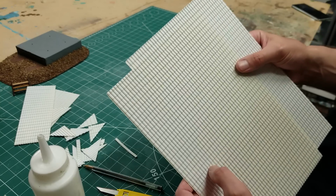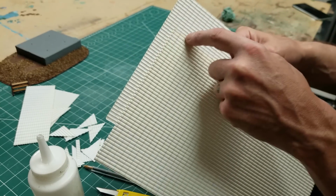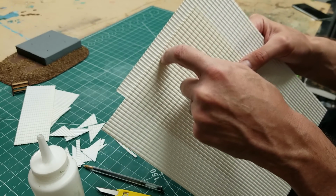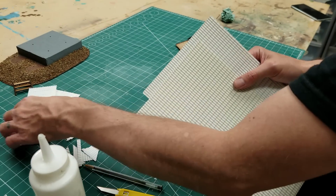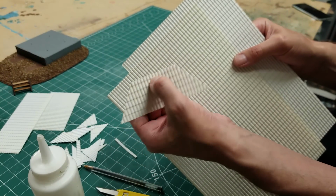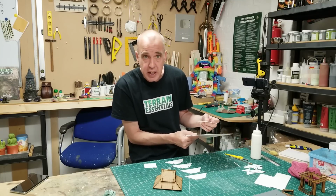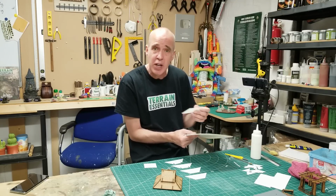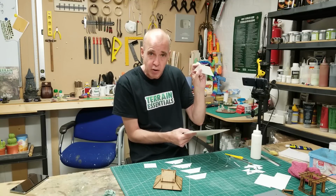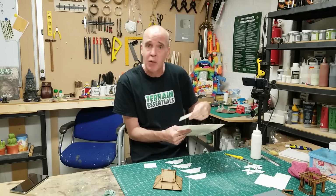When you start off, just remember that they have these edges around, which are sort of half cuts. Trim these off and go from the top of a full tile. I made this mistake in my first one, and I actually started my cutting with half a tile because I went straight off the top and measured straight down. Completely wrong technique. I made a mistake there, didn't spot it and didn't realise how it was messing things up, because although I cut the top row of tiles off, the next row started with a full tile, and so this piece didn't fit any of the others, so I had to recut.